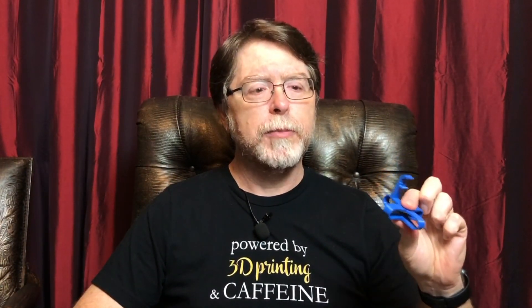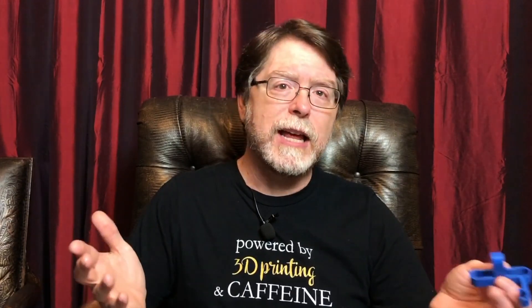On to number two: dampener feet. One of the things about 3D printers at the low end of the price scale is they tend to be loud when they're printing — not just because of the stepper motor drivers causing the motors to be loud, but also because a lot of the vibration from the printer's various moving parts can be transmitted from the printer's feet into the table it's resting on, and the tabletop can act as a sounding board amplifying the noise. Sometimes this vibration can even show up on the surface of your prints as ringing or ghosting. But these vibration dampener feet help to solve that — they absorb some of that vibration, preventing it from being transmitted to whatever surface your printer is on. They may also help a little bit with ringing or ghosting because they absorb some of the energy when the printer changes direction.